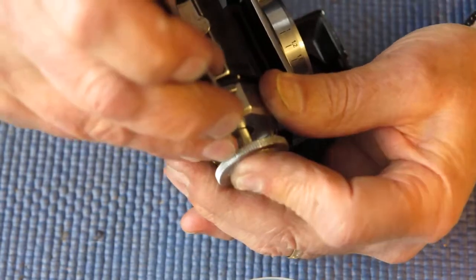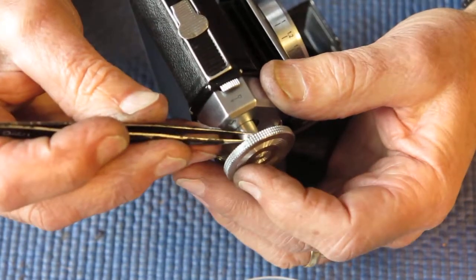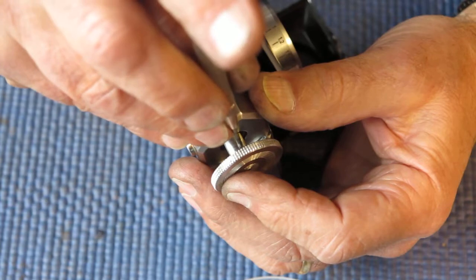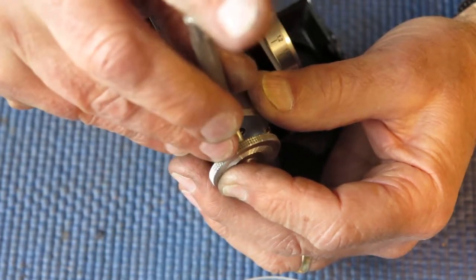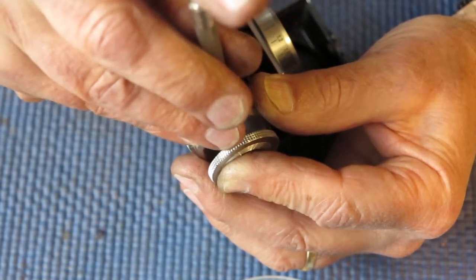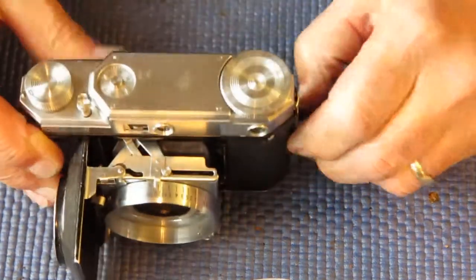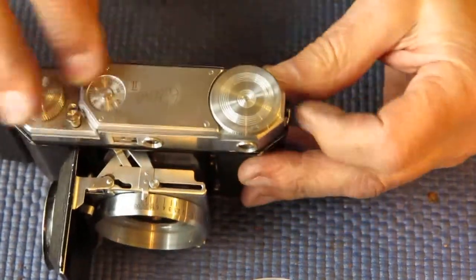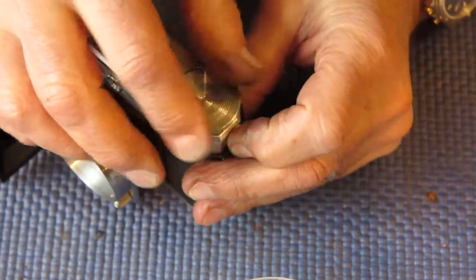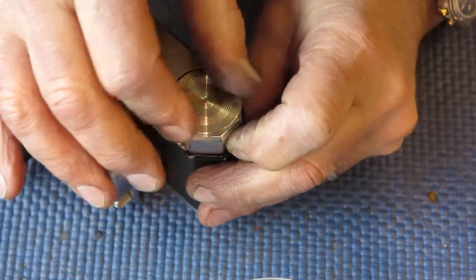Usually I would have to attempt to do this 2 or 3 times before I ended up with the rewind working correctly. For one reason or another, the J-shaped spring would fail to hook behind the ball correctly. The rewind knob locks into position, allowing me to view through the rangefinder. If I hold back the rewind button at the end and rotate it, I can't, the ball's not dropping into place correctly.